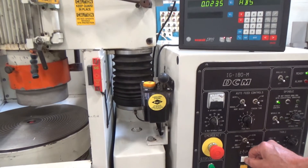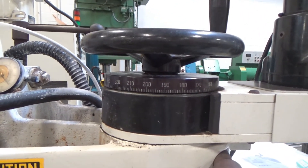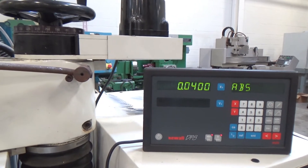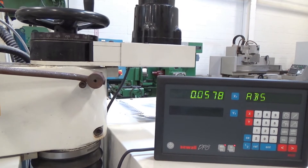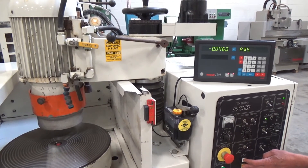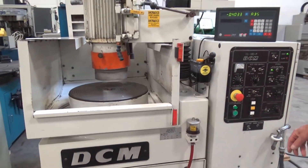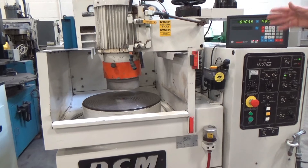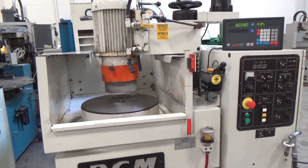If you go to times ten factor, it does just what it says — 71, 81, 93 — and times 100, you'll see that hand wheel move now. Moving up and going down a little bit. Back to 25% for the left side. Continuous jog would be this button here. Going down at 50, and 100 — moving right along. We have room above the wheel, so we're okay. We can call that home now, and from here we just touched off our part. I'm going to set it up to take off about 8 thousandths — zero out X, call it 8,000, and enter that. That's what we'll feed in on.